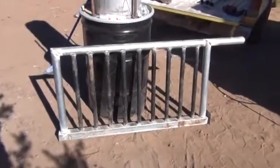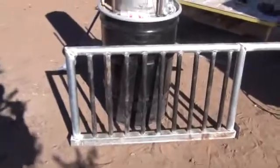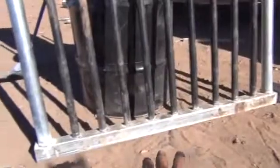I've got the third and final radiator now completed. Before I put it into place, I wanted to go through with you exactly how it works, where the baffles go and the direction the smoke flows. Let me take you down into this — we're going to have some shadows in the way because of the time of day. If I set you down inside of there, you'll see the iron baffle welded into place inside of there, just beyond the two inch pipe here. Smoke is going to enter in from our bed rail radiator here and travel up that pipe.